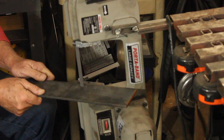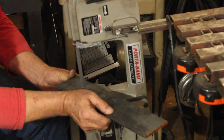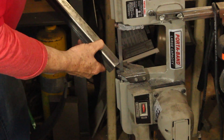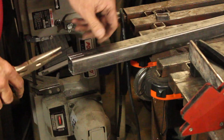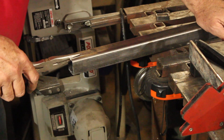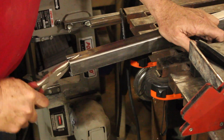I cut this quarter inch steel plate to act as a reinforcement for the steel pipe that I'd split into two pieces. Half of it will support the top, the other half will support the bottom. Here I'm cutting a lever that is going to drive the top plate down onto the bottom.